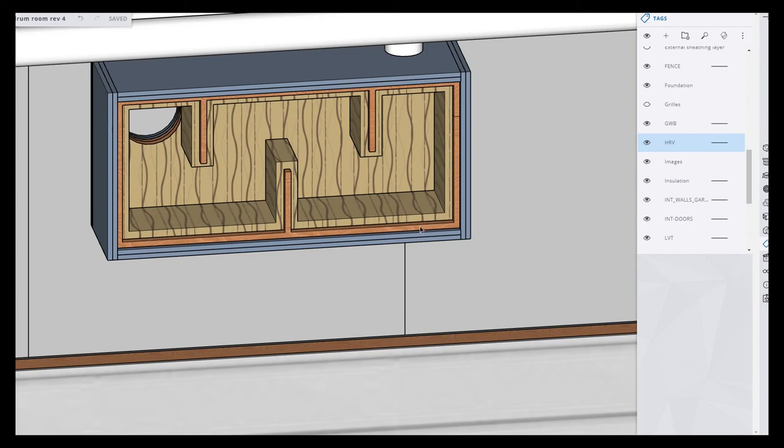And also inside of here, this is a plywood box. These are baffles. You can imagine the air is going to go wherever it's easiest. There's no air that's going to go to the bottom and turn. It'll go wherever is easy. So it'll be a pathway, but these at least produce angles. Angles help separate the noise. Just like air has to do some hijinks to get through here, the sound waves have to do that as well. So this is a plywood box with these baffles constructed.